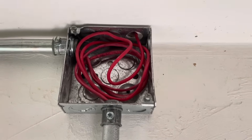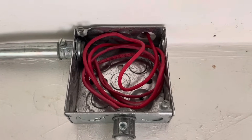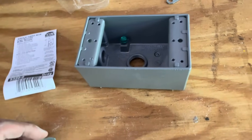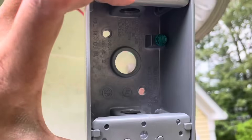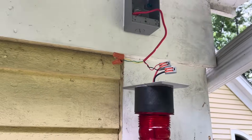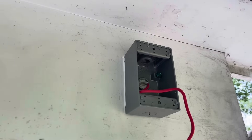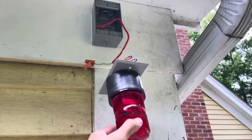So here's the wire — it goes up into the box, then into the ceiling, and then out to the new strobe. There are no actual connections in this box, just scrap wire — I always leave a lot of extra in case I need to run a little more or move something around. Now let's go ahead and install the beacon. Here's the outdoor single gang box I'm using. To mount it I'm drilling out the holes rather than using the side flanges so the holes are as close as possible. I'm feeding the wires through the hole in the middle and I've put some caulk on the outside to help it seal against the wall. This is a four-conductor wire so I've capped off the audible side for now, though I have that option in the future if I wanted to add a horn strobe out here.